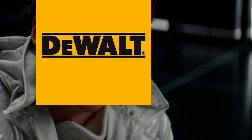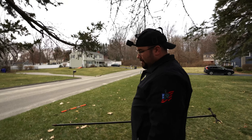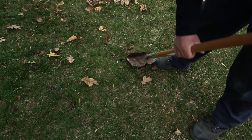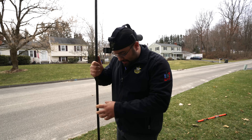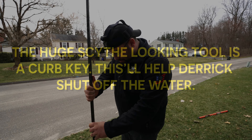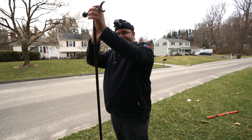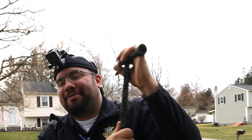I know you were disappointed. I was disappointed. So we were just trying to find the curb box, which is the tapping main shutoff from the road to the house. The curb box rises up so that we can easily get to it. The problem with this one was it was buried and it is a tight fit. So it was a success finding it, but whether or not we're going to get onto it — that's going to be the next thing.